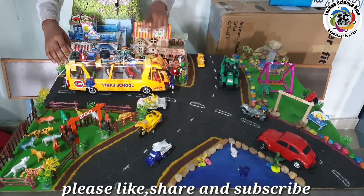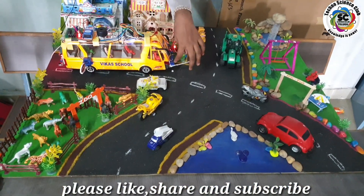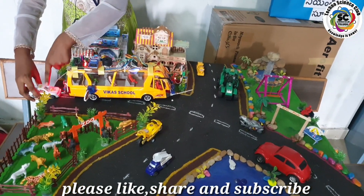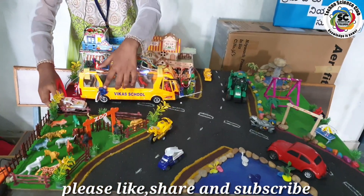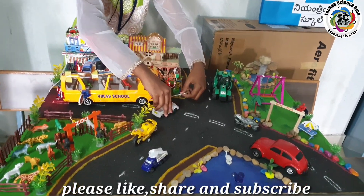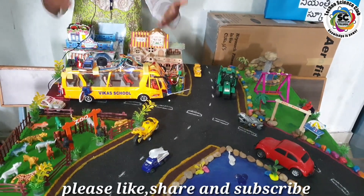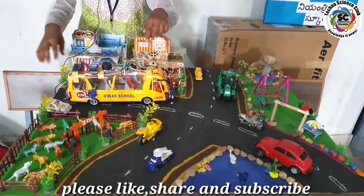When the bus is stopped, the moment the school bus driver switches the stop key in the bus, the data is given to the Arduino, and then the Arduino sends a shaft open command. Here the servo motor opens the shaft and the backside LED glows. Then the children can get down from the bus. If any vehicle is coming, the shaft will stop it. The shaft is made up of an iron rod and will try to stop the vehicle so that the children can safely get down. Simultaneously, the driver can monitor the children within his visible area. Once the children are out, then only the driver can press the stop key again to switch off the shaft, servo motor, and LED, and can continue to the next stop.